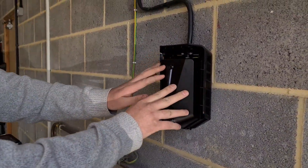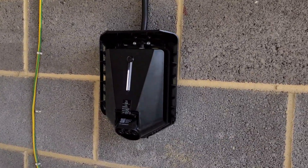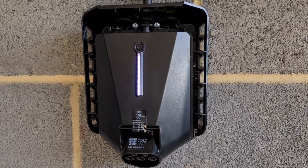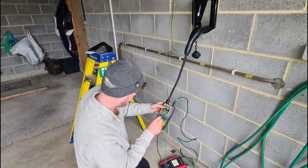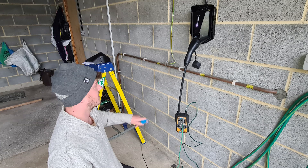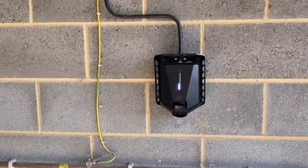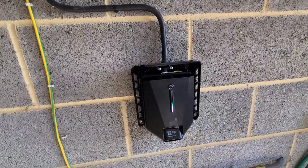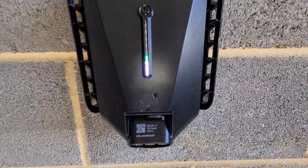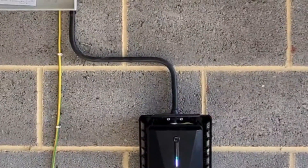Matthew connects the CPC correctly to the PME side. The front cover clips on and locks down — it's in and done. Power is applied to the charge point and you can see it fires up and needs commissioning through the app. Matthew puts it through its test sequence using his TIS MFT with the EV100 adapter — always test your charge points when installing EV chargers. On the wall you can see the cable route with linear invisible clips dropping down to the charge point, and it's running a firmware update.